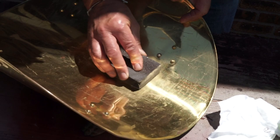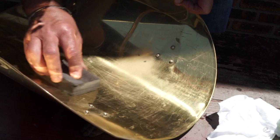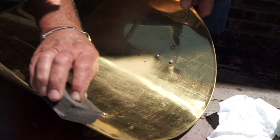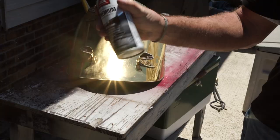You can see that the finish on this is pretty not that durable, so I'm just going to go ahead and take the sandpaper and just rough it up a little bit. This is going to help with the paint to stick a little bit. You don't have to go crazy, just a quick little almost scratching of the surface on all the sides using the sanding sponge — this will help the paint bond really well so it's a more durable finish when you're done.